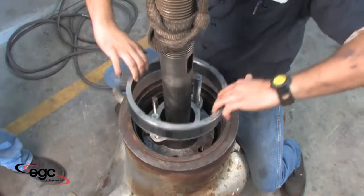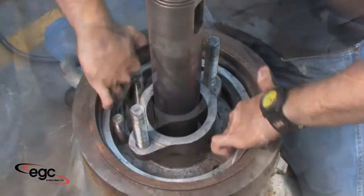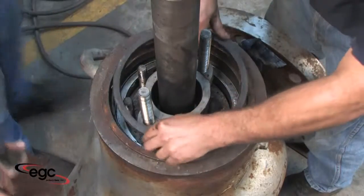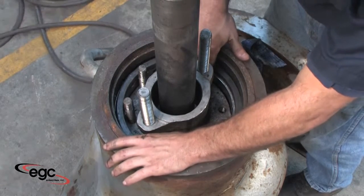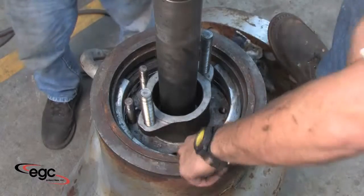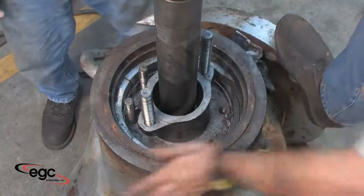As I said before, sometimes the as-shipped height of the VSG Pro may inhibit your installation process. So let's talk about a pre-compression step that can make your assembly of the VSG Pro much easier. Place the VSG Pro pressure seal into the valve cavity. Then place the backing ring onto the pressure seal. You'll need to measure and record the compression necessary to install the segmented keeper rings. Remove the backing ring and place the segmented rings in the valve groove.